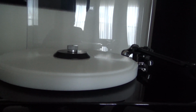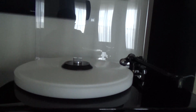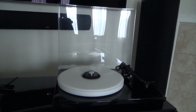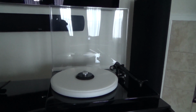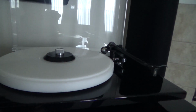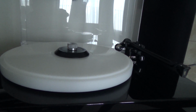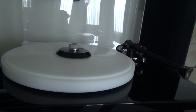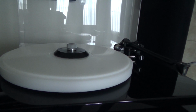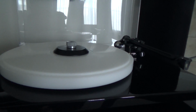So once again, you get a little bit of a power spike going through. So now I'm using the improved power supply, and I'm going to switch on and off the power controller unit and we'll listen for the spike. So I've hit it 3 or 4 times, and you can now hear that with the improved power unit I'm not getting that little spike going through the system.